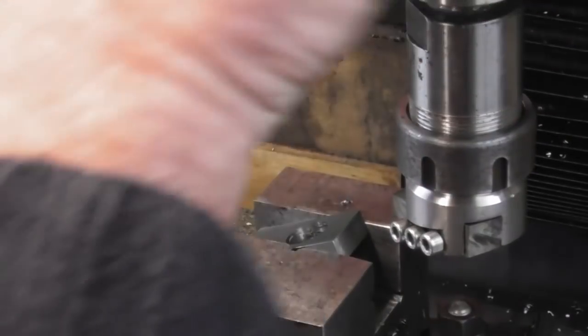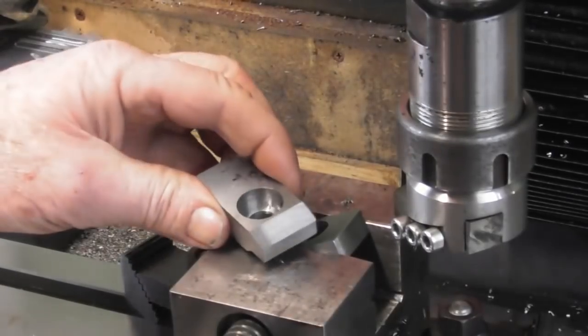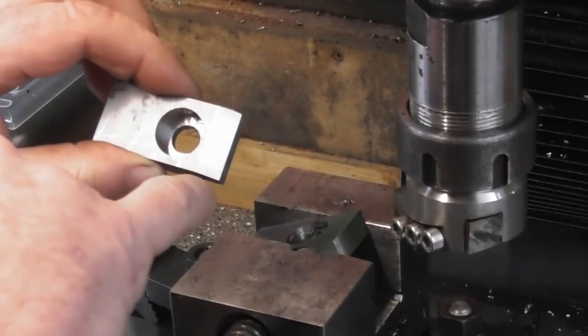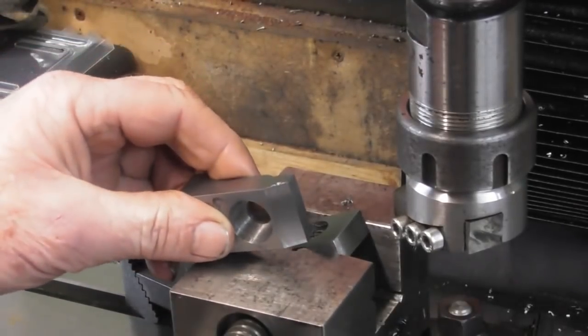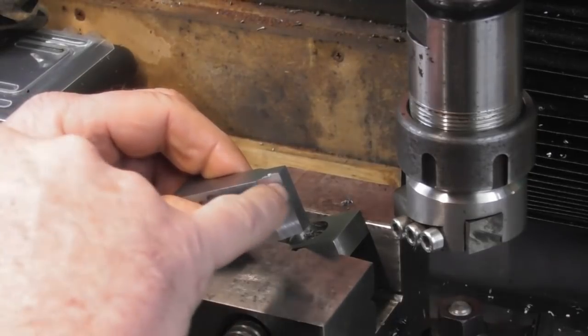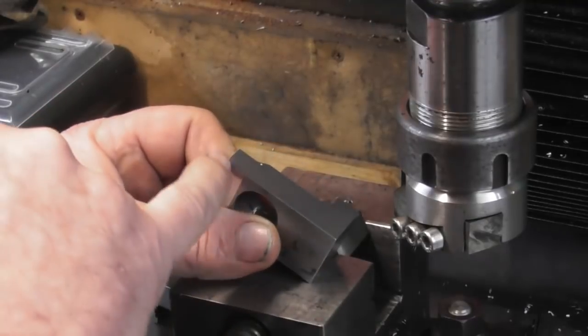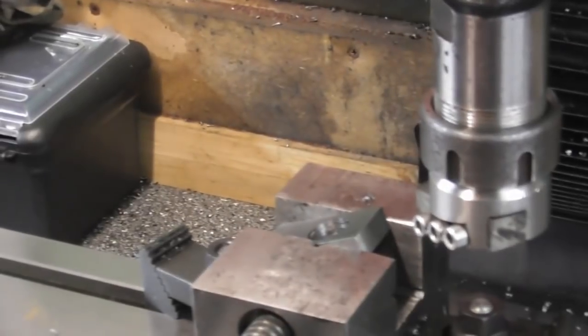So yeah, I'll wind my cutter back off, come back across, touch off on the top, take 3mm, and it should replicate the angle I put on the end of that one. And I'm going to do something similar on the two outside edges as well. Yeah, I'll get an angle that looks about right, touch off, intersect that point, and I'll do the same thing with the protractor from the other side and do exactly the same. So I'll probably show you the finishing passes of that.